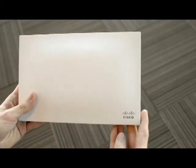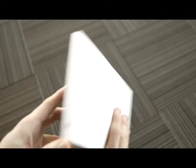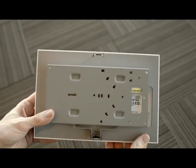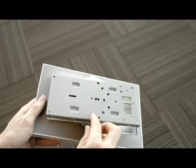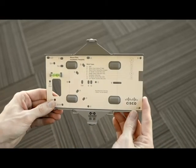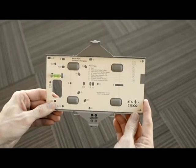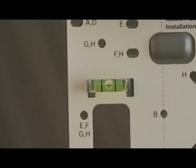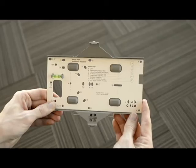The MR32 and the other AC APs have a slightly different mounting bracket — this has a push fit clip. If I turn the access point over and use my thumb here to press and lift, it detaches from the access point. The mounting plate itself again has that template, but it also has one extra feature: a cool little spirit level to make sure you mount your access point with those straight edges nice and true, so it looks good when it's on the wall.